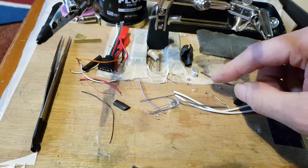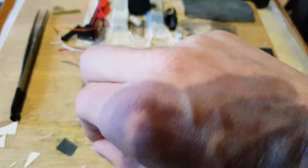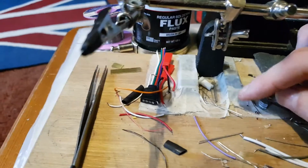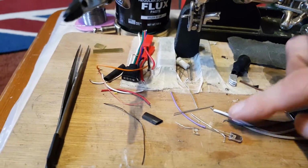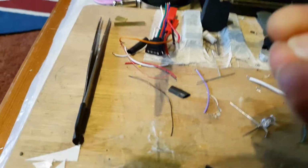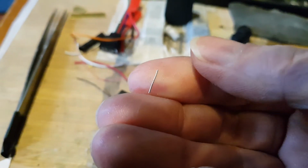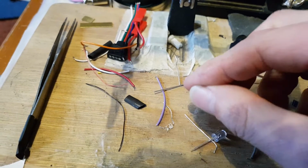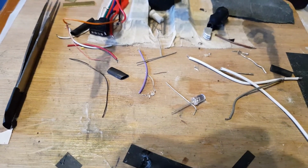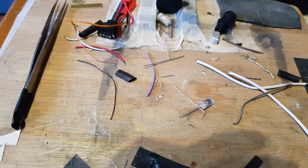because you can cut them down in size and, basically, you can use them to bridge joints, like say the SMD resistor pads for instance. You can use them to bridge the pads on the SMD resistors for the data line on the Collector Labs boards, if you're going to use the external resistor on the data line for the NeoPixel. So you can use an offcut of that to bridge those two pads.